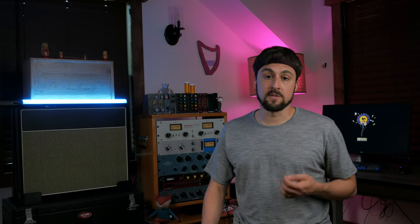I have a bunch of different speakers, so I decided to upgrade to the MOJO 768SP output transformer. The OT has secondaries for 4, 8, and 16 ohms. You can choose a single secondary to wire up, or you can wire multiple secondaries to an output selector switch. I wanted to have options, so I installed a Mojotone impedance and mains selector to switch between secondaries.